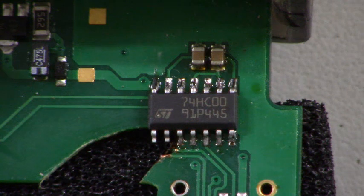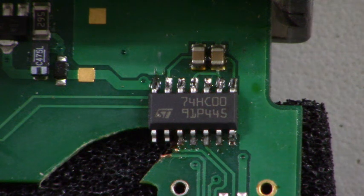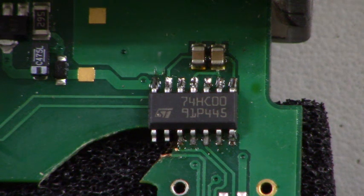Now for the fun part. Trying to get pins 1 and 2 connected to their respective IC pins on that HEF4013. I'm going to use wire wrap wire to perform that connection. That's going to be a bear because look how small those pins are. Shooey! Now you thought soldering that surface mount IC to the board there was the tough part. Wait till you see what's coming up. The things we do around here. Well, hopefully we can resurrect this one from the dead. We'll see. We'll see.